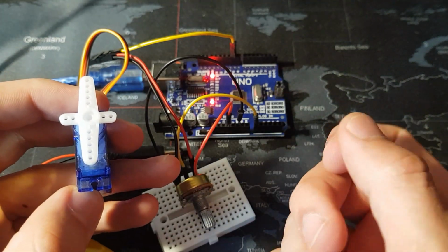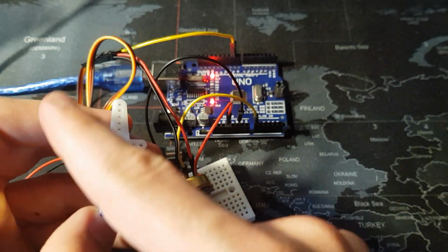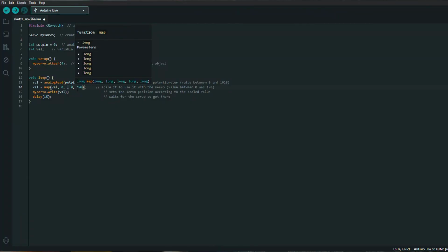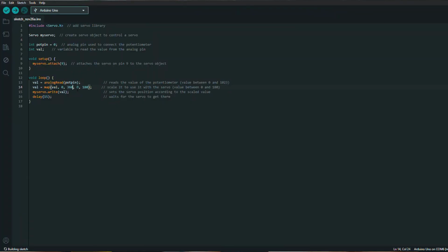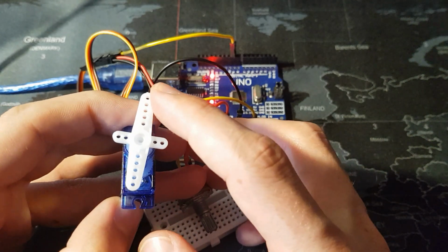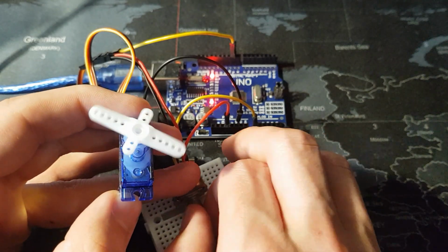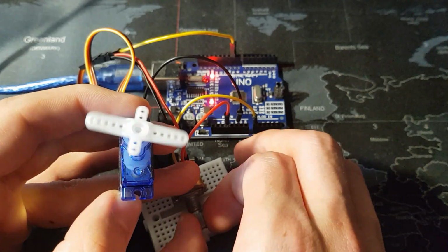So in one rotation of the potentiometer, it would go from starting point to end point back to starting point, and that's not what we wanted. So I upped it to 360, and now it's basically 180 degrees, and when we turn the potentiometer, it returns back. I'm not sure why I always seem to have some sort of problem with whether it be code or my building of the circuits when I do these videos, but luckily that one wasn't too difficult to sort out.